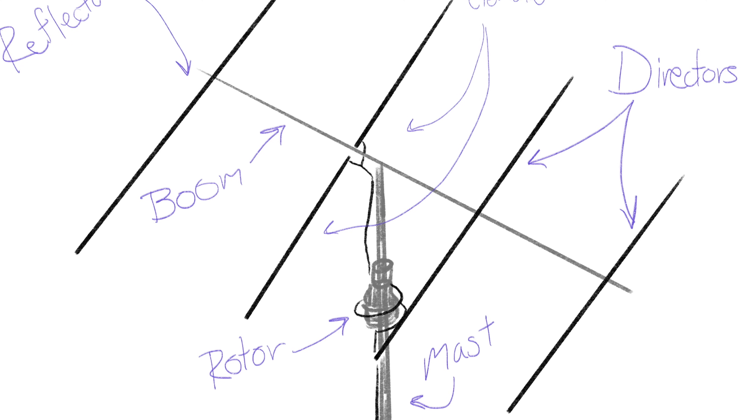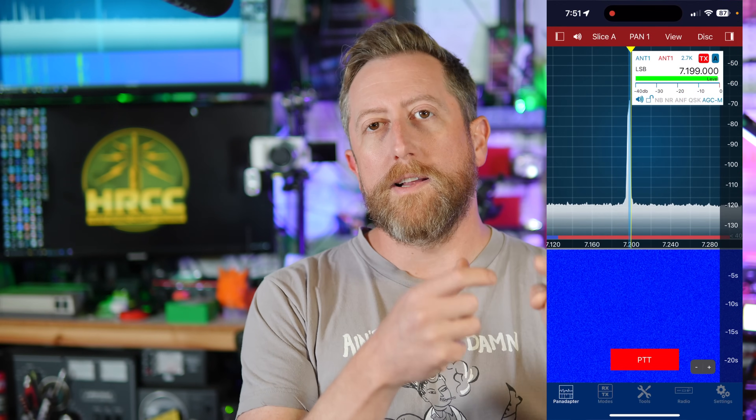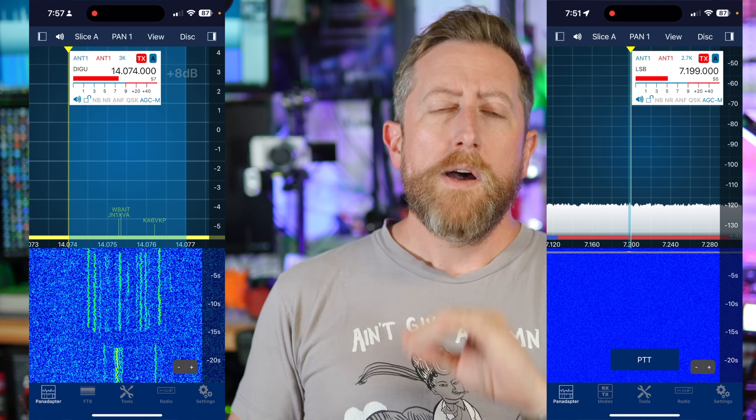This goes beyond just operating the radio. When we're in front of our radios, we take for granted things like rotating our antenna if you have a rotor, or just being able to turn it on and off. Now, with single sideband and even FT8, the radio's handling a lot of that — you're literally just sending an audio stream that gets modulated and sent out of your radio. Morse code is a little more precise than that because you need to key in your dits and dahs. And sending an audio tone of the Morse code doesn't really work — it doesn't convert as easily.